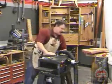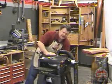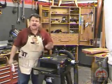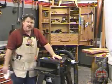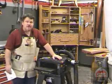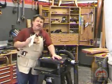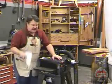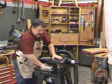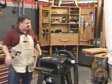The tool works better and has a lot more power that it can use for cutting wood if you keep the table lubricated. And because the table is constantly being used, you should do this every time you use it. Not every board, but every planing session. Remember, you apply the wax, then buff it out. Don't sit there and let the wood rub the wax off.